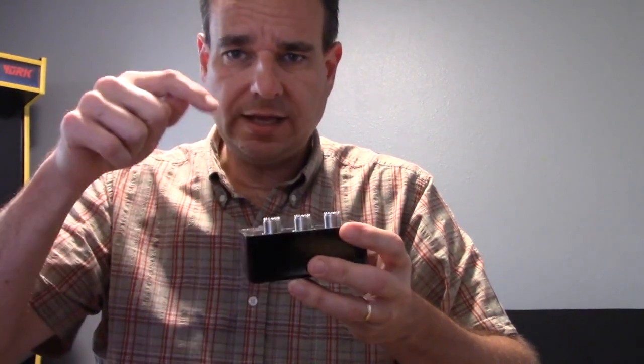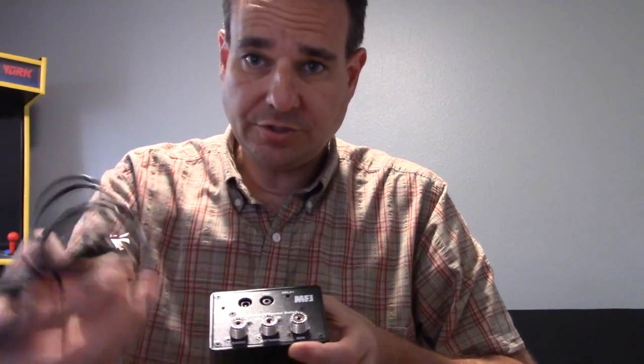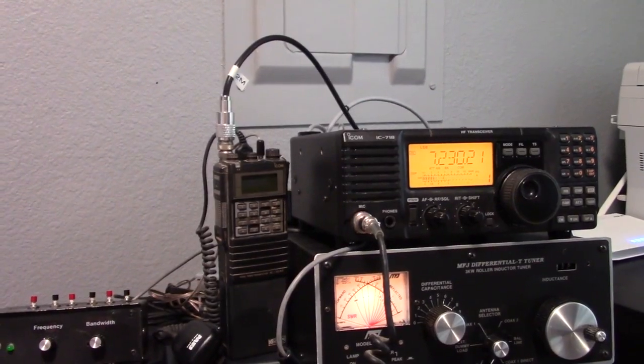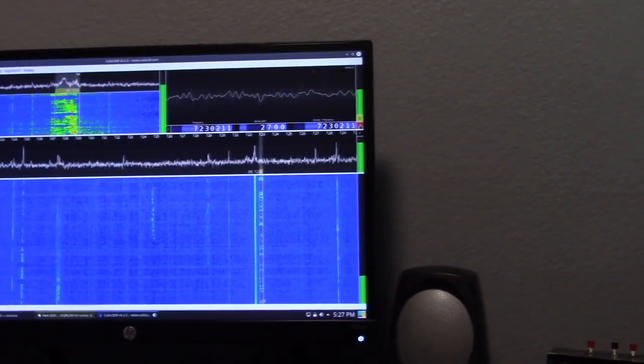What is this? I think I explained it already in the video. What this allows me to do is hook up my radio and my software radio that we've already seen. With the push-to-talk switch, anytime I transmit, it'll take the antenna and disconnect it from the software radio and hook up the regular transmitting radio — so I'm not transmitting into the software radio and blowing it up. So I can do more than I actually thought. The radio is always connected, and when I transmit it will not interfere with the software radio. Perfect.